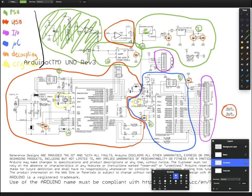So, it's really important to have these protection mechanisms because maybe if you're tired or you're a bit stressed out because your debugging isn't going well, you can really easily just plug something in backwards and it will blow up your whole circuit. So things like connectors that can't be put in backwards are really good, as well as protection circuits such as using a diode or maybe even something more complicated.